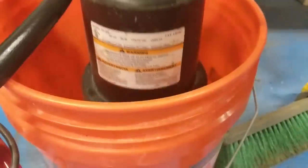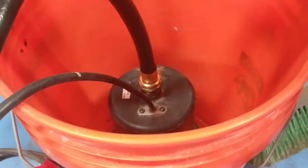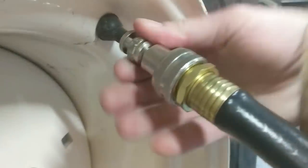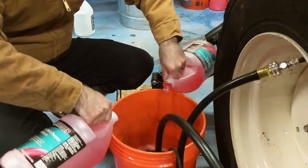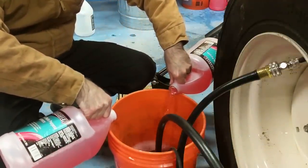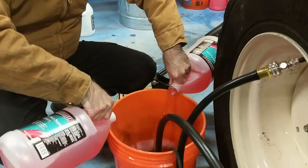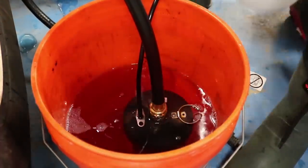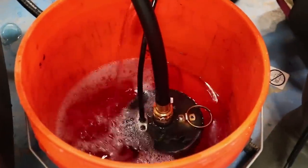The sump pump worked a lot better than the drill pump, but it did require a little bit more fluid since you have to have it around the pump. You do want to keep the pump submerged in liquid because it helps keep the motor cool. One of the main reasons I chose this antifreeze is that it's actually potable — it's designed to winterize the water lines in an RV and has a freezing point down to negative 50 degrees Fahrenheit.